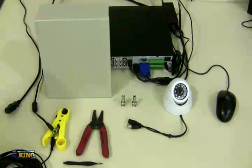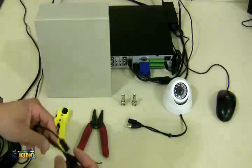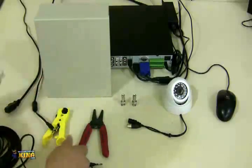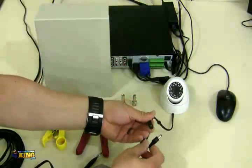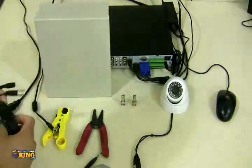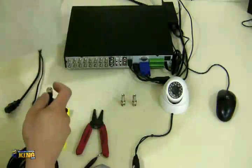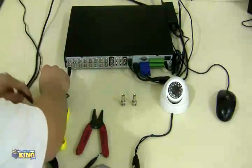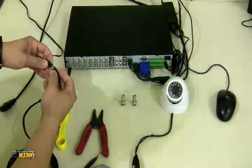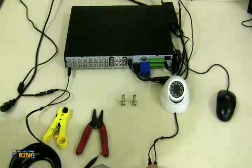The simplest way to use a plug-and-play cable: on one end you connect your camera — first the BNC connection, then the power. It's recommended to connect video before power. The other end connects on the back of the DVR on one of the video inputs, then you connect the power. That basically completes the connection, and you will be able to see the display video on your DVR.